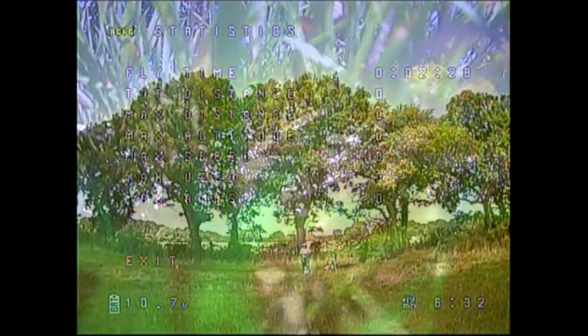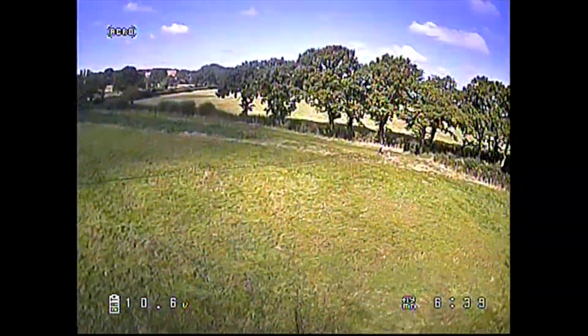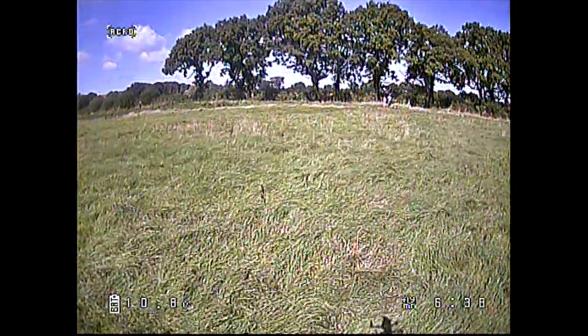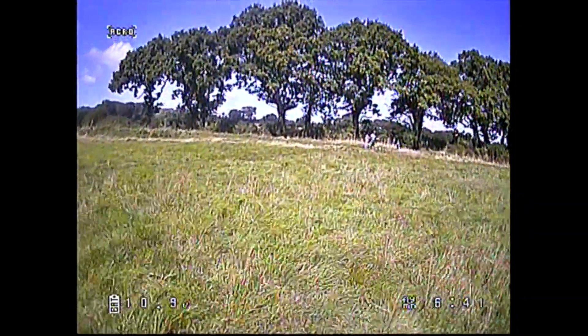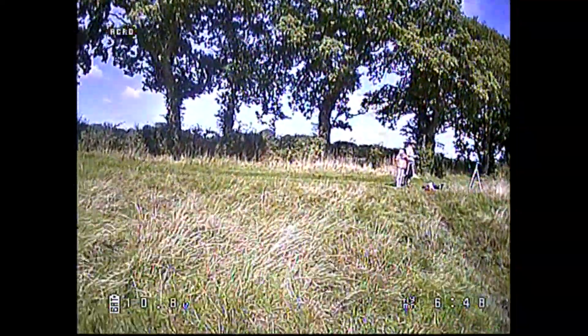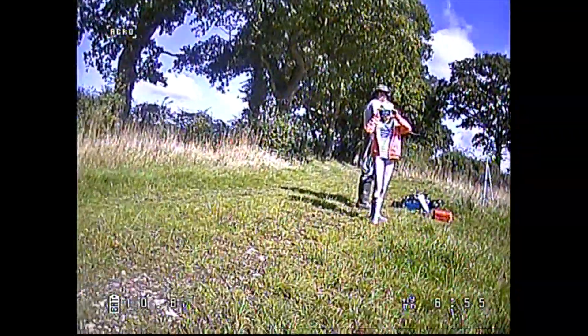You'll note here that it survived a crash quite nicely and even gave me a little summary screen to say hey, I've flown for this long since you crashed me. I set up a low voltage alarm at 10.5 volts which flashed up correctly, and I've got the beeper in my nose so that beeped along as well. So in conclusion, I'm really happy with this little OSD and especially the MWOSD firmware. It does everything I want on my 250 quad and it's about as cheap as you can get — even if you just want a voltage and a timer OSD on a little plane, it's easily adaptable. I haven't had the chance to make the little PID adjustments yet, but I really like the fact that I can do that easily. So I highly recommend it. Thanks and see you next time.